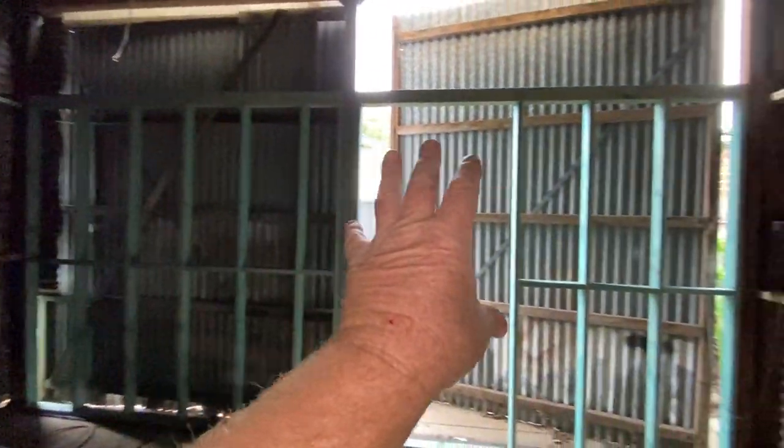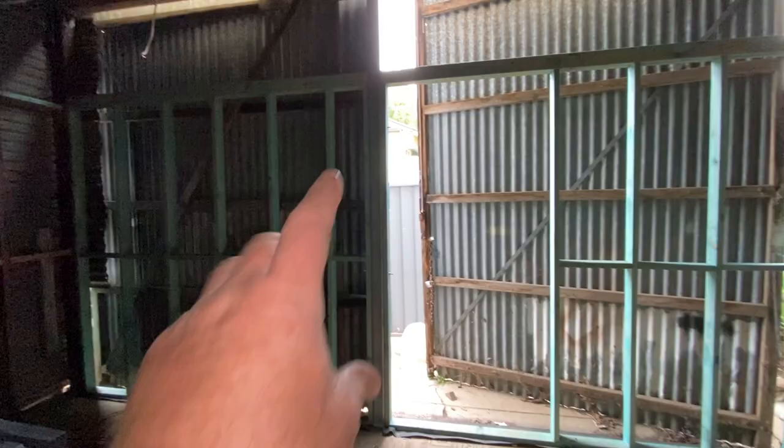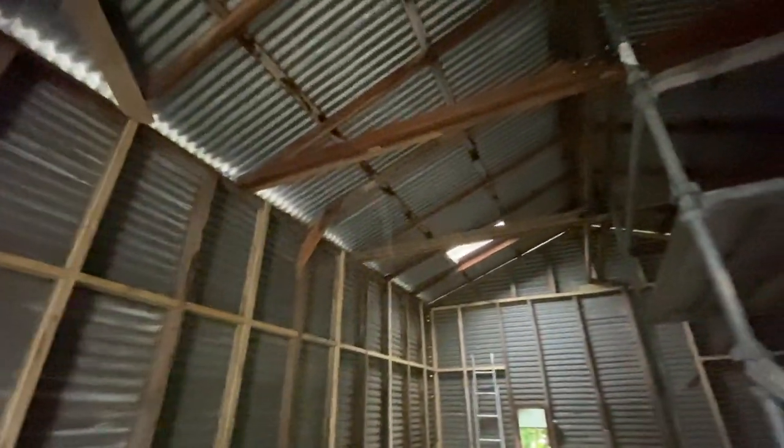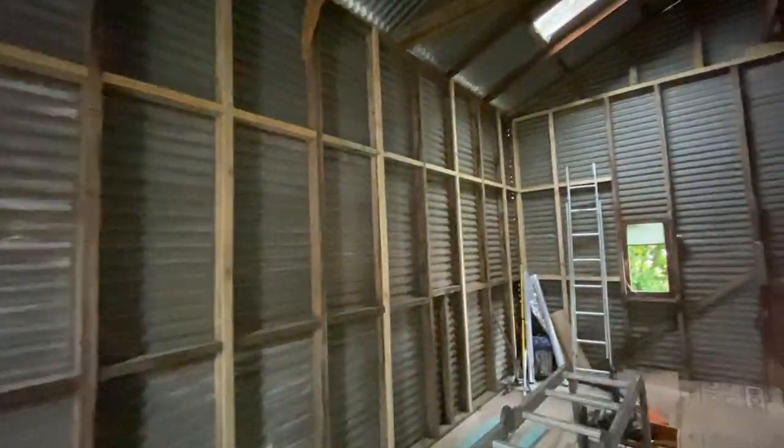Starting to wall this wall out. The windows are up there as we've pointed out many times. So I've left this gap here — we're going to load in all of the timber and stuff that's going on these walls and the ceiling, the lining boards. We've battened out this to get it all level and put in some noggins to brace the wall up.